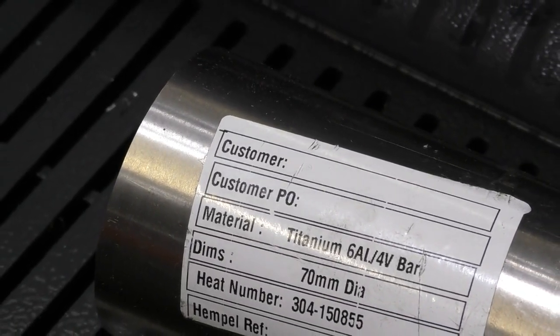It can cut even non-ferrous materials — plastics, wood — and from aluminium all the way up to nickel alloy. If you are cutting harder materials like duplex or nickel alloys, then this isn't quite the right machine, as it's a bi-metal machine.